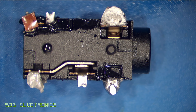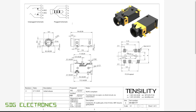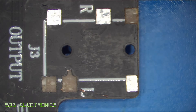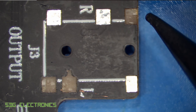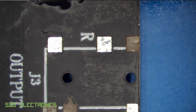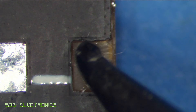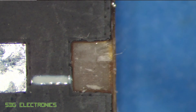Here's what the jack looks like on the underside. I found a similar item on DigiKey — part number 54-00177. It's got the same footprint, the same two holes in the PCB, and the same detail for the internal switching contacts. That's only 80 pence to replace. The datasheet shows the arrangement of contacts internally, so we can work out which connections to be careful of. Looking at the PCB, only three terminals were actually doing anything. There's a ground pad, and although on the jack one pad is electrically connected to another, it looks like they didn't actually connect it to the ground plane — there's a definite clearance between the pad and the ground plane, which is why this one came off very easily.